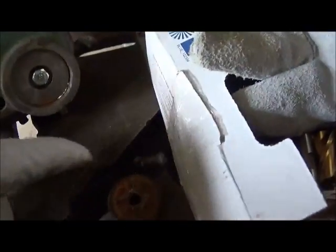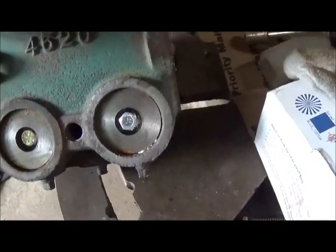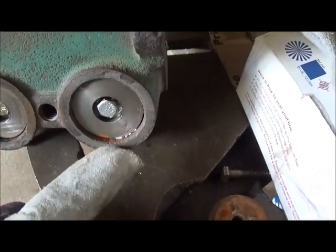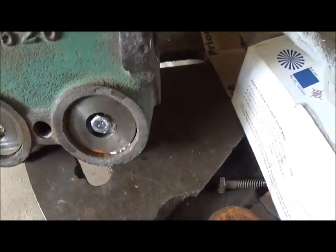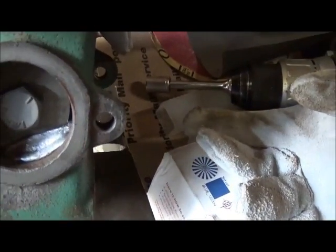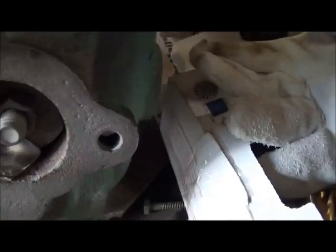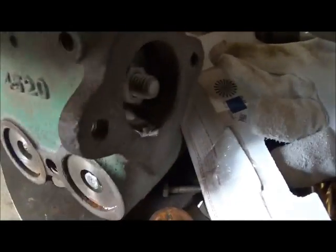I'm going to pour there. The casting is still a little bit hot — I ended up putting it in the oven. I didn't want to put it over the flame. You can see a little bit leaked through when we poured it. When I took the caps back off, this side doesn't look too bad at all. I think we can dig it out of there, machine it out a little bit and get it out. This side I got a little more in, but I don't think that's a problem either. I think we can get all that out, and we'll see if we can get the washers out and see what she looks like. Hopefully that'll work.